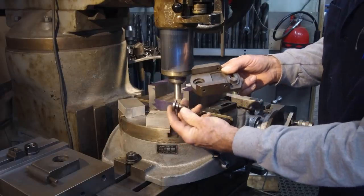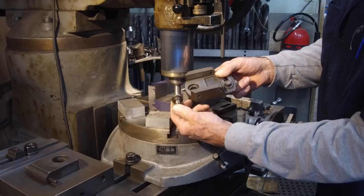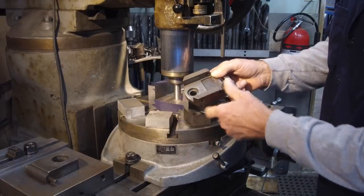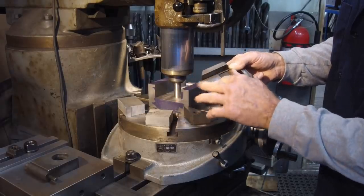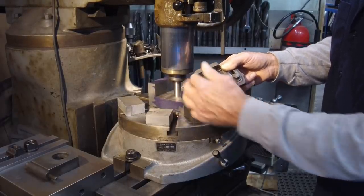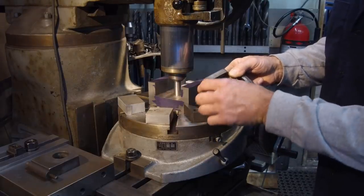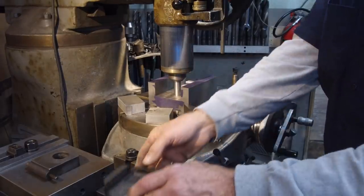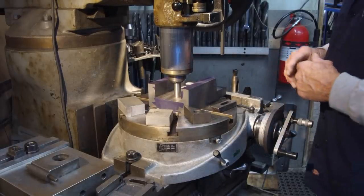This pivot right here is a flanged screw, and it basically is allowing you to pivot there. So we're going to come in and put that recess in. It doesn't have to be exact, because we're going to turn the screw to go into this afterwards, so we can make this diameter whatever we end up with there. We will shoot for some kind of a diameter, meaning a nominal, and if we make it, we make it.